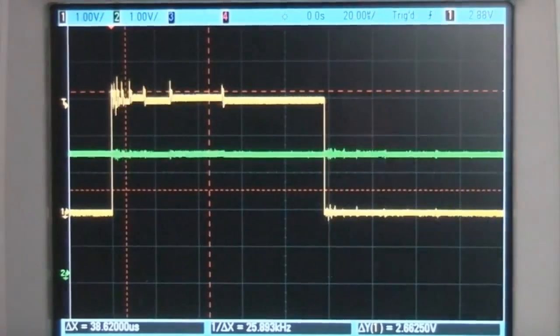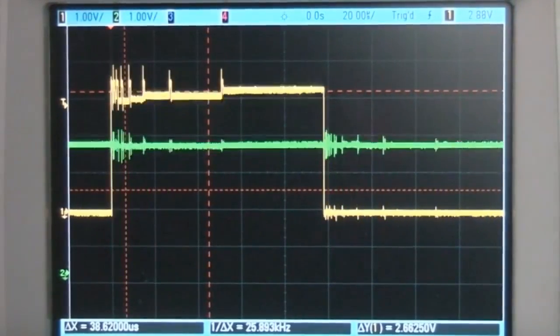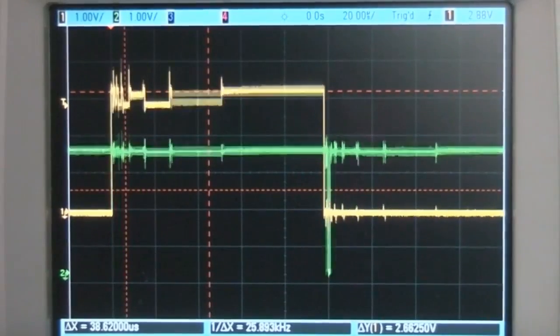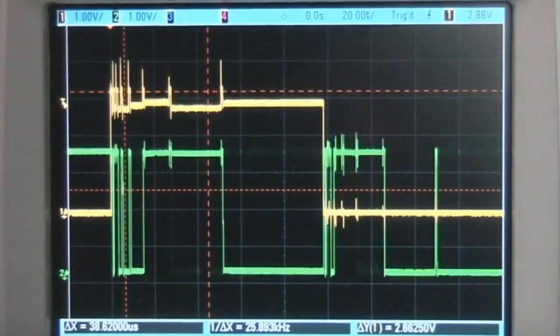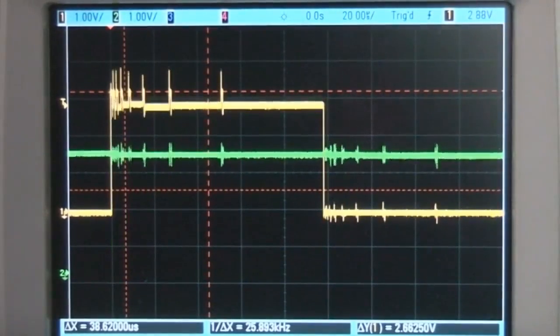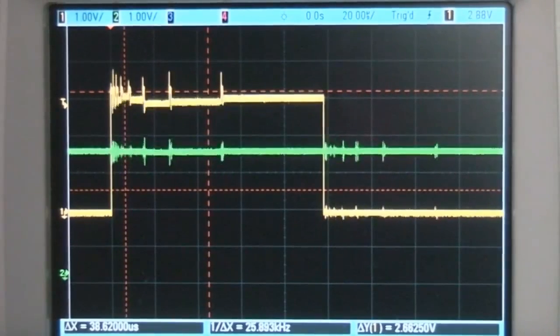There is obviously scope also, although this is normally 3.3 volts, to crank the voltage up a little bit and get a bit more drive out of it. I can't remember off the top of my head what the absolute max on this FPGA is, but I did accidentally run it at 4.2 volts and it still worked. At some point, maybe if I hooked it up to a cheaper FPGA, I might turn this up and see how far it will go.